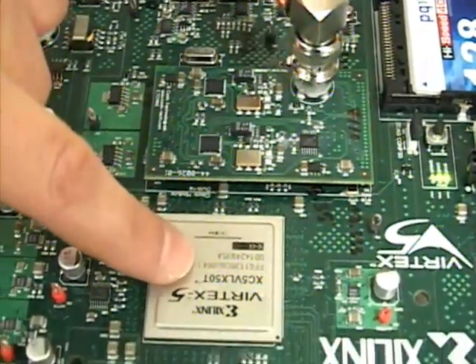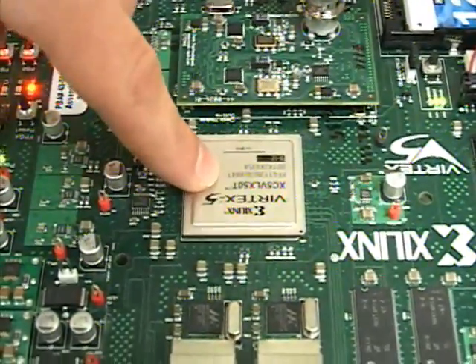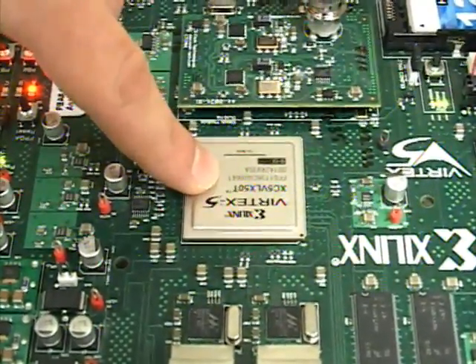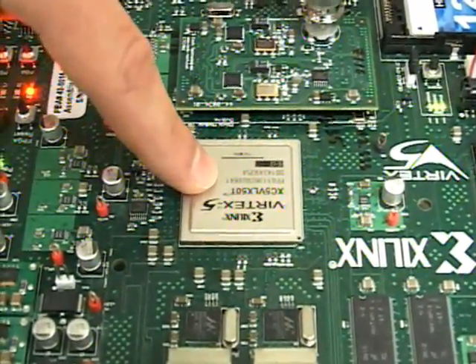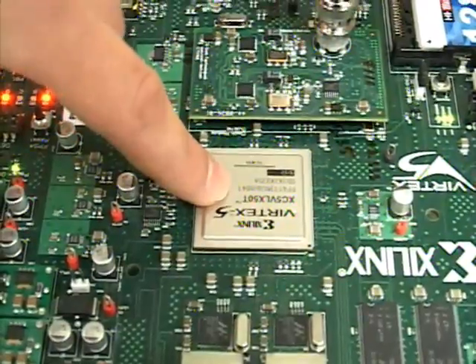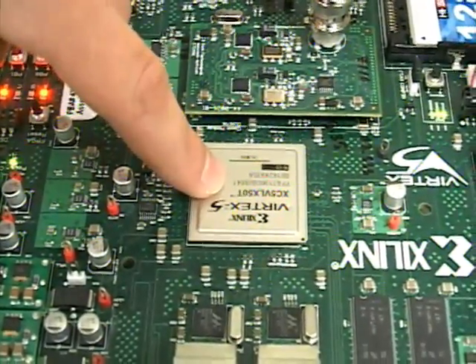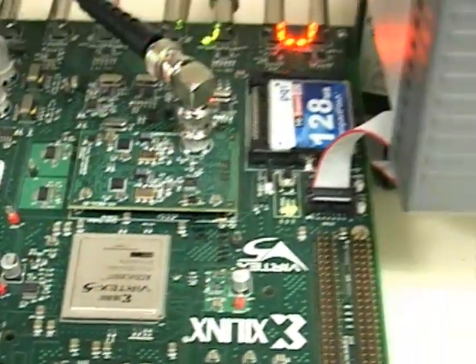The timing that this chip generates based off our reference is sent to the FPGA. The FPGA has firmware which we include and it also controls our clock generation chip. This firmware will generate an SDI video signal as a test pattern. The test pattern can be seen here to the right on our waveform monitor.